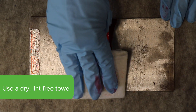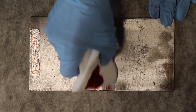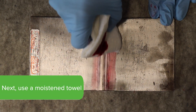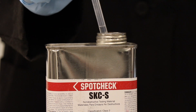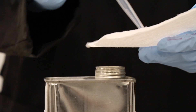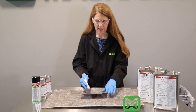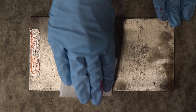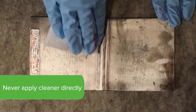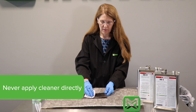We're going to start with a dry towel and wipe to remove excess surface penetrant. We're going to follow that up with a slightly moistened towel using the SKCS cleaner, being somewhat cautious to not over remove. It is very important to never directly spray or apply the solvent cleaner onto the part during this step, as it could potentially remove penetrant that's in discontinuities.